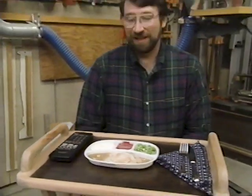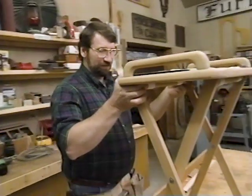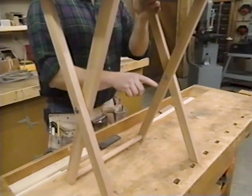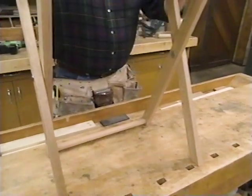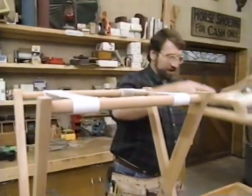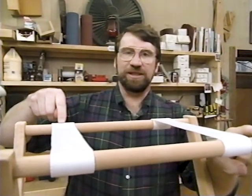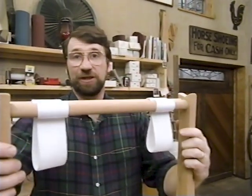Dinner is served. Now if you build one of these, you won't miss a second of the New Yankee Workshop as you view it from your favorite television chair. After looking at all the different tray tables, I incorporated the features that I thought worked best in ours. There's no stretcher across the middle of the X-brace — just one at the bottom, so nothing gets in the way as you sit under the tray. Up at the top there are two stretchers with nylon webbing in between, which restricts how far the X-brace can open, yet makes it very easy to fold up and store.